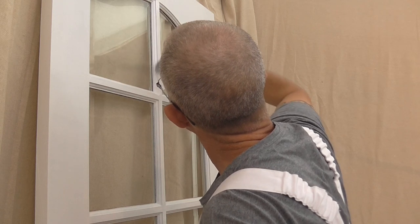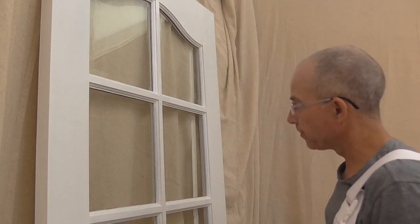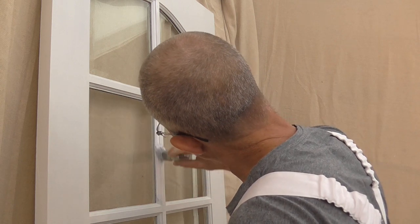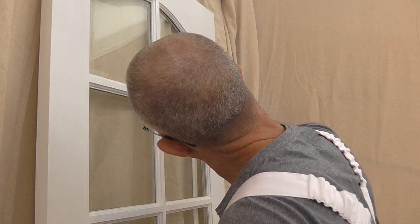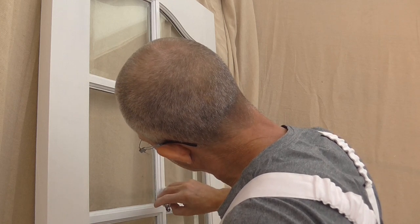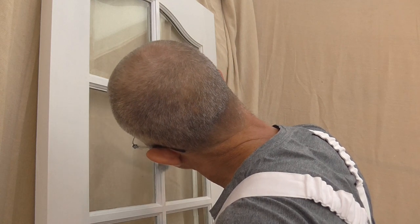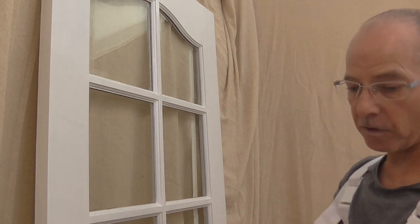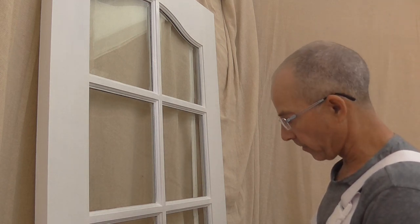If you put too much paint on, it's going to run everywhere, so you've got to try and make sure you spread it out nicely. And always go over and check your work, because if you spot a run, you just wipe it out as you're working. Kept in water. The thing with using a brush, as you're working, there's bits in the stock there drying, and you've still got to clean them out every now and then to make sure you get a perfect finish.